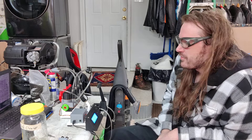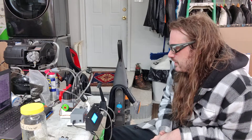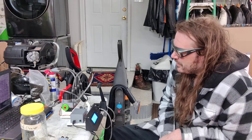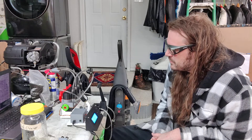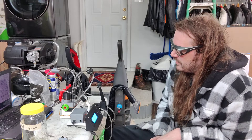We got 69 watts of power and still the same 44 ounces of torque. Having that extra airflow only gives us a higher top-end RPM — it's not actually giving us more torque because the same amount of pressure is still being applied to the piston. Interesting how that comes through on the dyno. But yeah, 69 watts at 8,800 RPM — that is ridiculous for a four-cylinder. That's the most I've ever gotten. With two compressors before I was getting around 6,000 RPM, so to hit 8,800 like that is huge. This thing sounds like it's going to explode but I know it's bulletproof from the way I've made it.